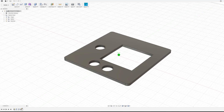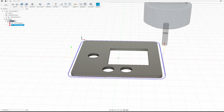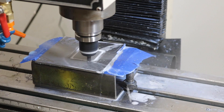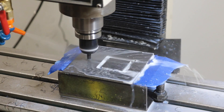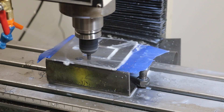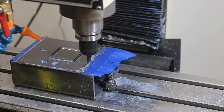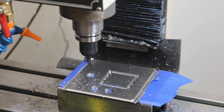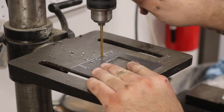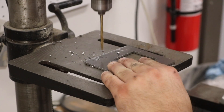The faceplate itself was actually a fun little project within a project. I modeled it up in Fusion 360, first 3D printed it to get a feel for everything, and then came up with a CAM routine and took it over to the CNC milling machine. It's eighth inch thick, 11 gauge sheet metal — the same stuff I used for the base of the oven. I'm going pretty conservatively because I'm using the superglue and painter's tape holding technique, using a piece of 2x4 tubing as my base. I was also testing out the tool holders, the tool itself, and my new coolant mist sprayer.